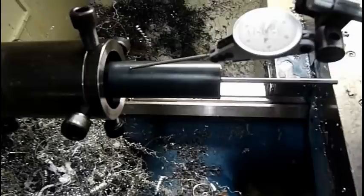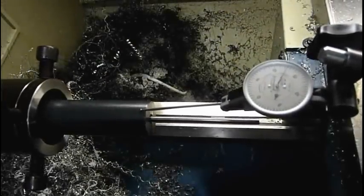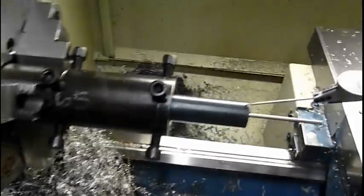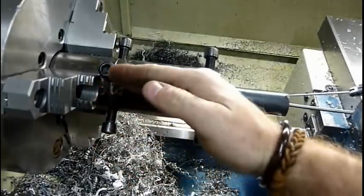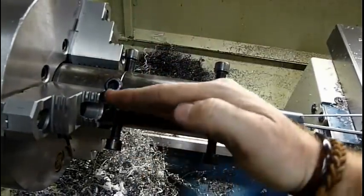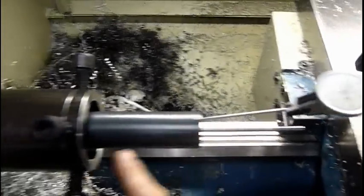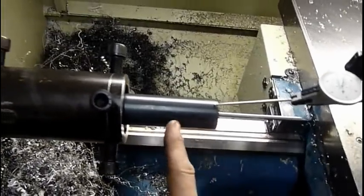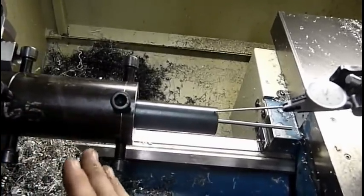Now that it's centered, you run out to the end of the barrel and turn it. That part will be way out normally when you first put the barrel in. Because now that you can clamp it in two places, it'll be centered close to here, but the barrel may be tilted — this screw is in further and this screw is out — so the barrel is on an angle. It might run true right here but it's going to be nutating around. So you dial in the back one until this one becomes zero, come back and zero this, then go back and zero that — back and forth, adjusting front and back until the outside is running square and true.